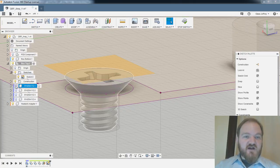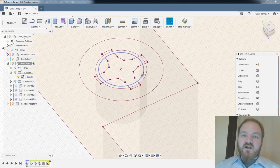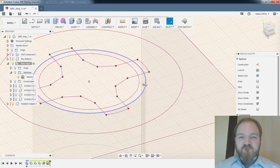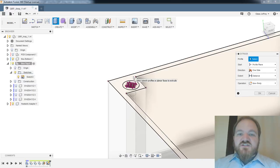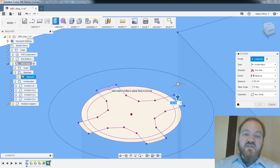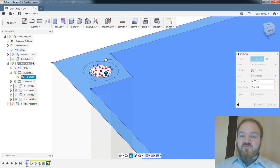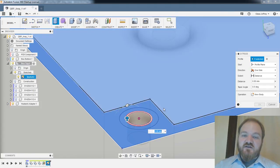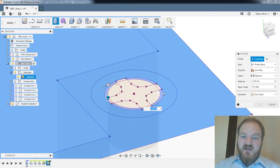Huzzah, huzzah. So the project we've been working on is building a little network monitor. So I'm distracting myself. I think this is the right geometry. So that the spot ops could see the level of their spot when they're operating it manually. So basically, it's slurping network lighting data, which is sACN, off the network, and displaying it on a little screen. And that's all there is to it.